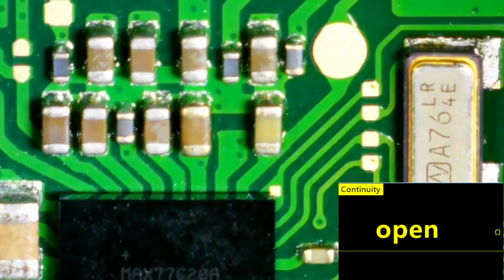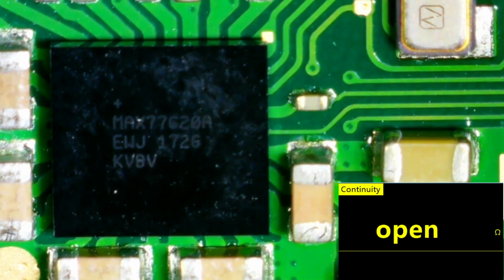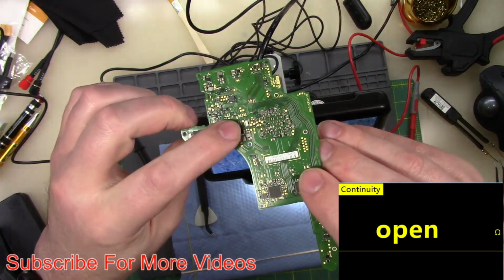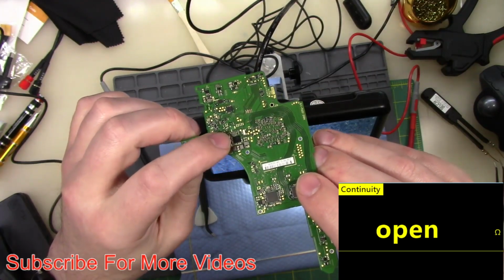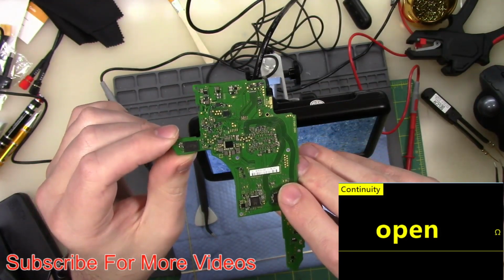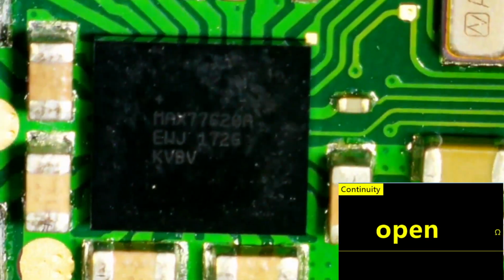So I was like, man, this was racking my brain because this chip seems fine. It's getting power. So I've been digging a little deeper, and if you look on the back of the board, I can't zoom out any further, but let me just show you here. Take that off. If you look on the back of the board right here is a Maxim chip. It's a MAX77260, a PMIC, power management chip. It's a BGA chip. So let's go back to this one, and now let's take a look at this chip here.